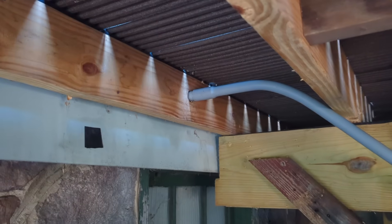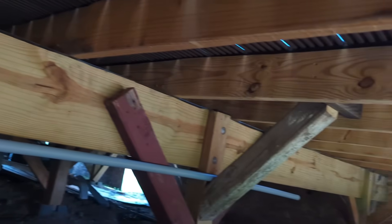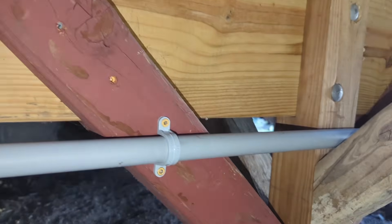I'm priming and gluing and adding clamps where required. After making a couple more modifications on the conduit, we are getting close to reaching the exterior wall. After passing the conduit through the exterior wall, I use some spray foam to seal everything. Then I continue the same process under the deck to make the PVC conduit reach the required length, making sure to fasten the conduit with clamps. Working under this deck was the worst part of this installation.